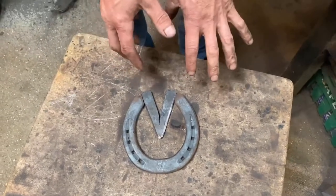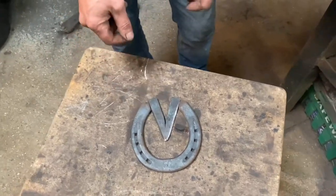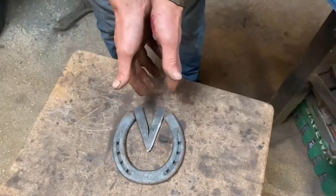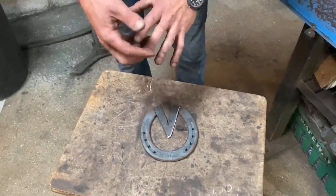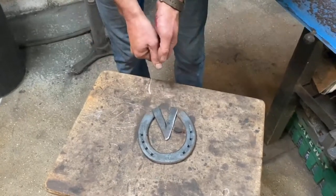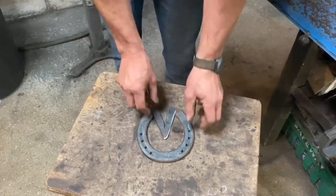And I've got scope with this shoe when I'm at the horse. Because this frog plate's got a V in it, I can widen the shoe, I can tighten the quarters, the heels. So though I've made this shoe to fit Paddy and I shouldn't do anything to it, I've still got room there that I can alter it. Whereas if this was a solid frog plate, I wouldn't be able to do that.